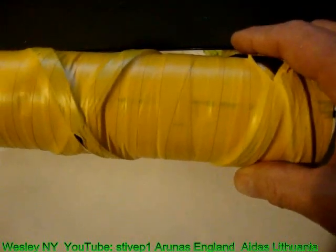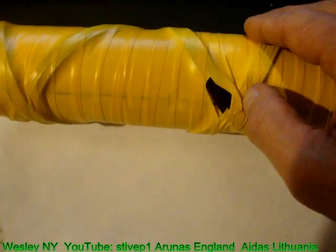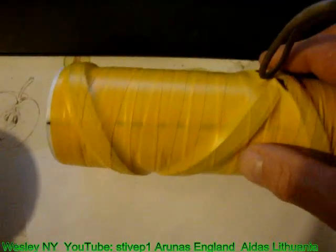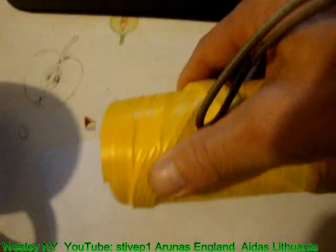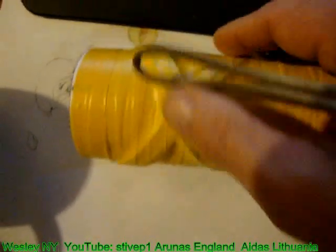I said in a few places on this video that the caduceus has 4 wires. I was wrong. I just don't want to redo all of the thing. It's the third time that I'm doing it. The caduceus uses 5 wires, 5 wires of 1 millimeter. At the end, they are soldered together. One of the cross sections is not in line with the rest of the cross sections near the ends of the caduceus. Look at it carefully.